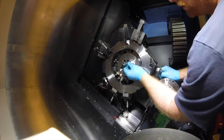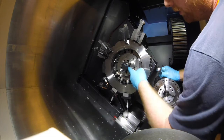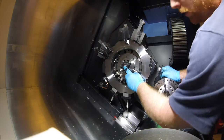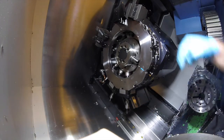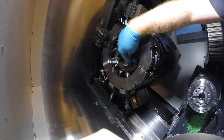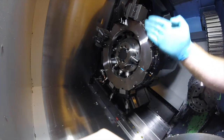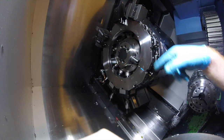If you ever want to check the condition of your bearing to see if it's broken, take this cover off and look inside. When this one failed you could see the bearing was not sitting central because the cage had collapsed on it. Here's a little internal shot — you'll be able to see the drive dog, see it spin around and locate to its home position. We might have to adjust it because it needs to be absolutely bang on, otherwise it hits the spigots when it goes to do a tool change.